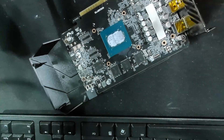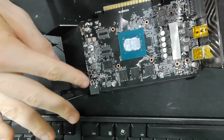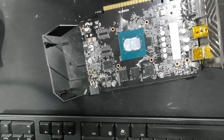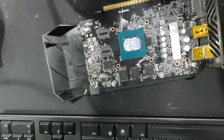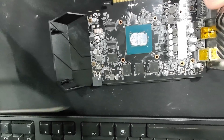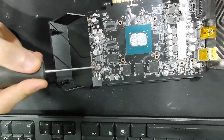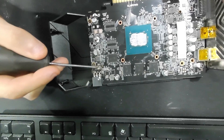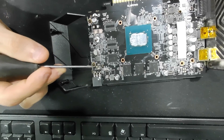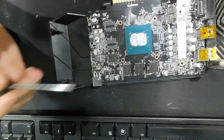Why is this better than soldering? If you ever need to take the resistor out for warranty purposes or an RMA, the glue is untraceable — it's so soft you can peel it off, take the resistor off, and there's never any evidence you were ever in here. You're allowed to take the cooler off to repaste your card, so you have a reason for taking the cooler off — you were never here, essentially. Also — quick point — you can't just put a wire over top of it. With Turing cards, there's a failsafe: if it doesn't detect a resistance at all, it'll put the card in safe mode and you won't be able to go over 300 MHz. So you actually have to use these specific resistors to get your shunt mod to work. This essentially increases your power limit so you won't hit the power limit while gaming.